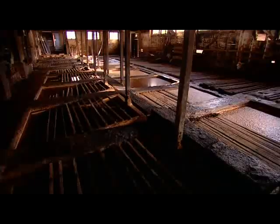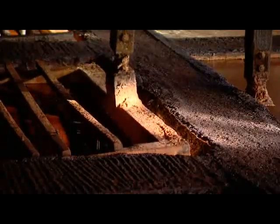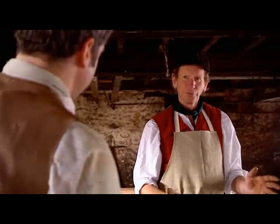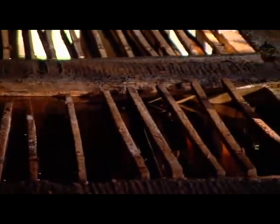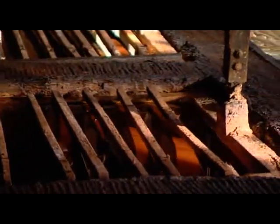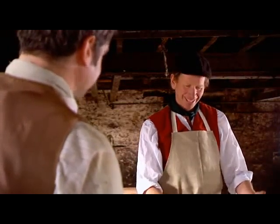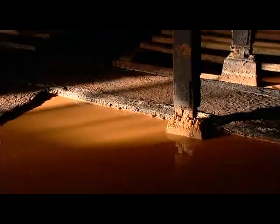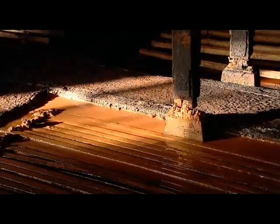Hides are attached to a frame in a weak mixture of water and oak bark, then agitated constantly by a giant water-powered stirring machine. We're taking a raw hide, which is putrefiable and can go off, and we're converting it into leather — and you can't reverse the process. Whereas if you've cured a hide with salt or dried it in the sun, that's reversible. This isn't. So it's a sort of alchemy. It goes in there for 12 months and comes out as something else.